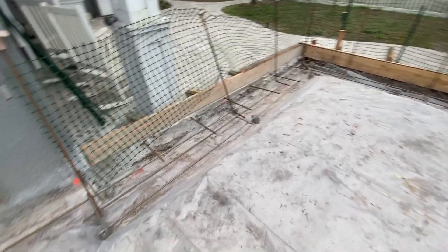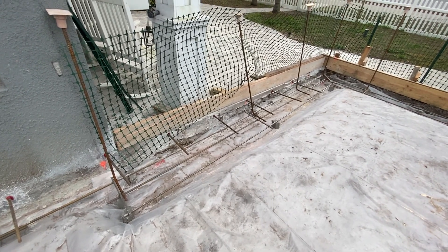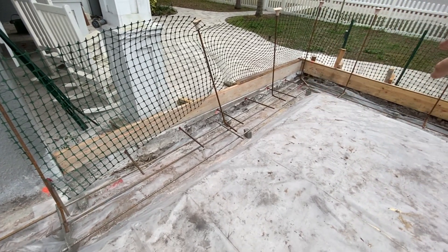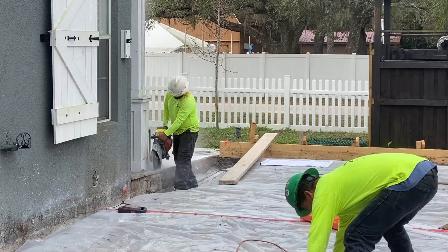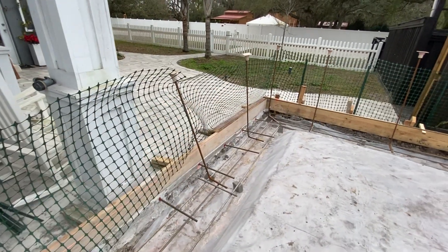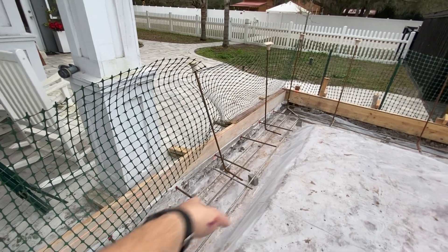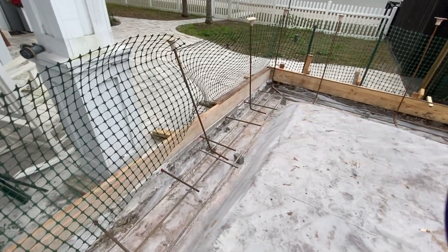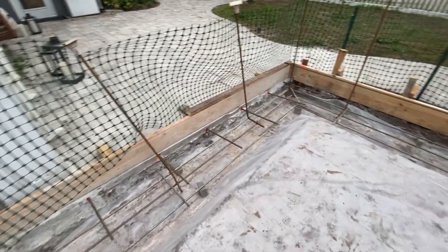This morning I had to make some modifications. I caught an error — they created this footing and we noticed the radius on the pavers up here encroached into the footing, causing this wall to be out of square. These are pavers on a four-inch slab, so I had the crew saw cut it to open it up an extra inch and a half, then had them dowel and epoxy into that as well. It made it that much stronger and created a perfect 90 degrees — we don't want concrete block cantilevering over any foundation.